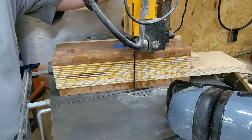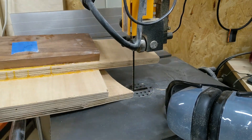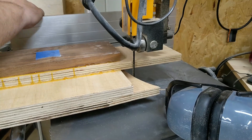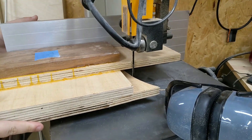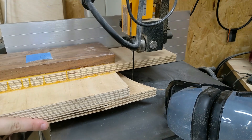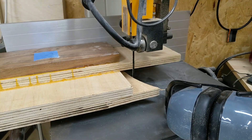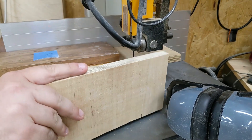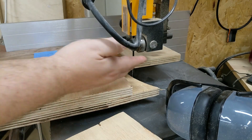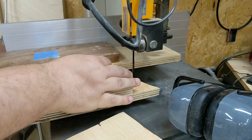There's just a small amount of gap. I want to get all of this extra here cut off — we're going to try to square this all off. I'm going to bring my fence over, gauge where we're at, line it up properly, tighten down the fence, and find a push block to shove this through. We can use this to push the block through so that when the blade comes out the other side we're going to slow down, but our hands stay out of the way.